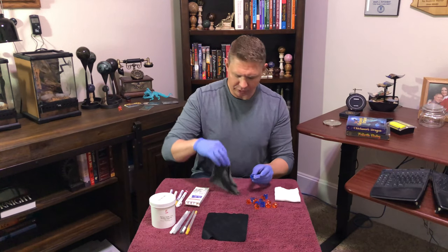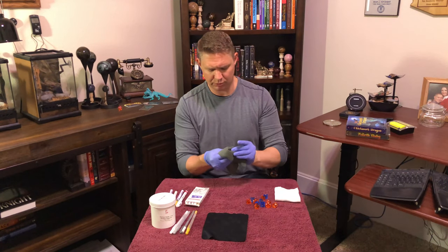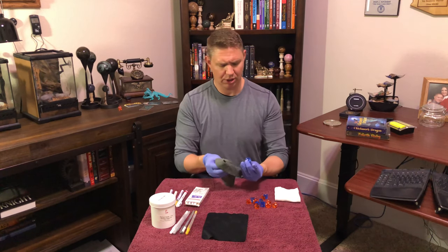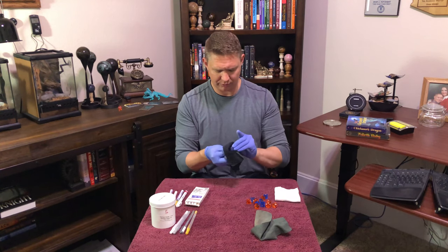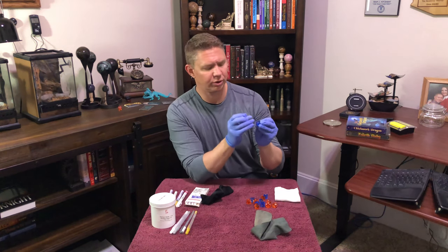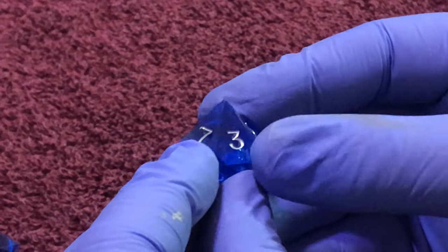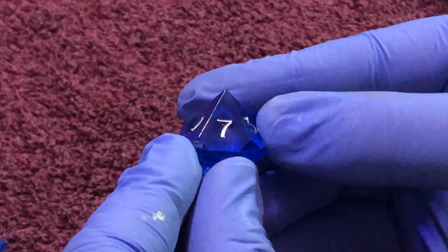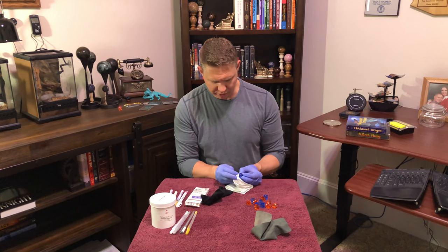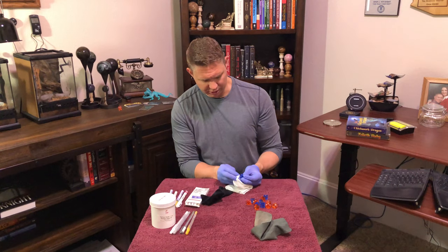Once I do that, I switch to the other side of the microfiber cloth to remove most of the excess Cerium Oxide — and I have no idea if I'm pronouncing that correctly — then I go to a clean microfiber cloth to finish off the polish. As you can see with the numbers I've done here, you end up with a really nice inked number and a clean face. The glass polish actually polishes up quite nicely, and a moist handkerchief will wipe away any Cerium Oxide that gets onto the mold point.